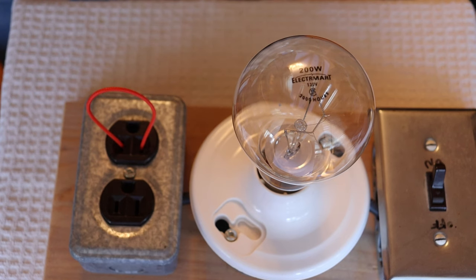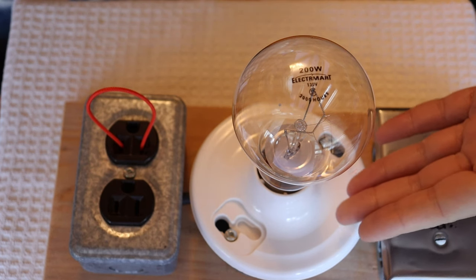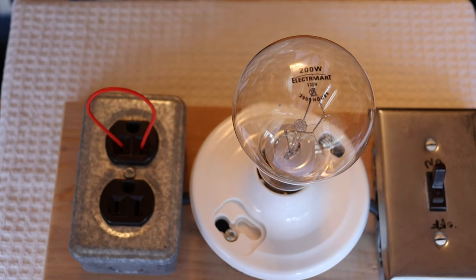If you've followed us for a while, you've probably heard one of our favorite phrases: the tubes are the amplifiers. Tubes themselves are an assembled collection of components — we call those mostly electrodes. With the exception of some very specialized types, if you have something that's going to amplify, it needs to have a filament, also known as a heater. The simplest form of a vacuum tube is a light bulb — just a heater inside an envelope designed to produce light, with a tungsten filament.